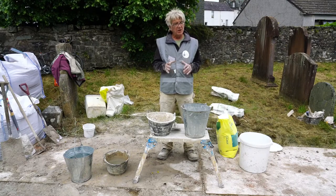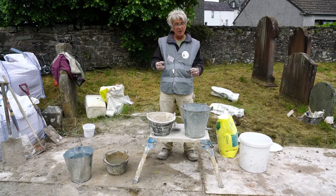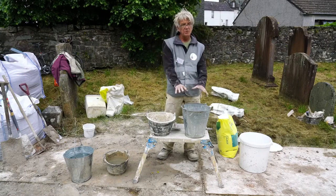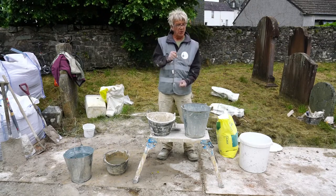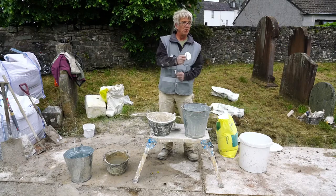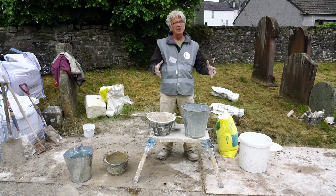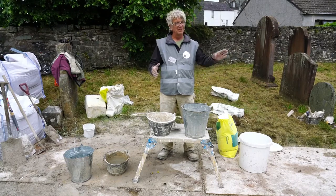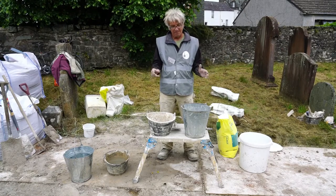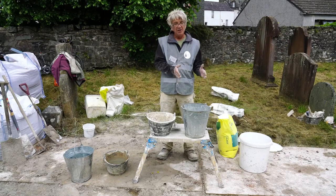And that, because of the nature of hot lime, which is taken advantage of for grouting walls, flows and moves when it's hot in ways that it simply can't when it's cold. So a grout poured in, which is essentially a lime wash, poured into the wall will find its way into every last hole in that wall and fill that up completely, making that a fully capillary active wall. I'm not going to say what we were talking about earlier. So treat this as a triple demonstration really. What I'm going to demonstrate now is making lime wash traditionally for hot use.